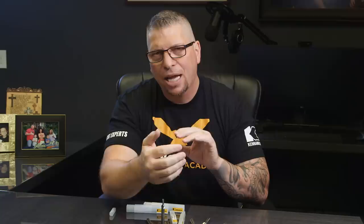I said blind holes — that means a hole that's not coming out the other side. When a form tap comes into the material, it pushes a burr on the backside, which then needs to be machined or chamfered cleanly so the thread remains perfect — and as tools wear, that's a problem. That's why when I have through holes, I usually use a cut tap, because it cuts the thread in perfectly without leaving a big burr, so the other side is easier to clean up.